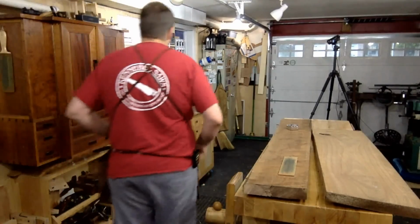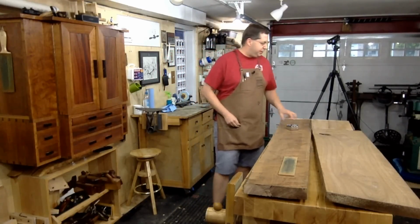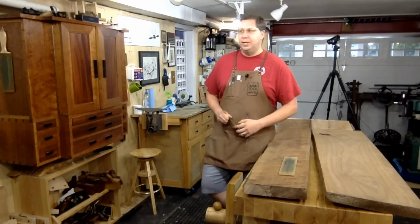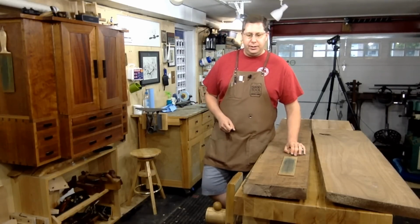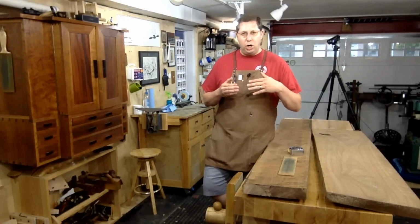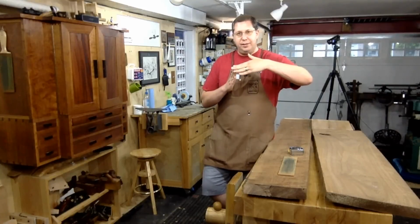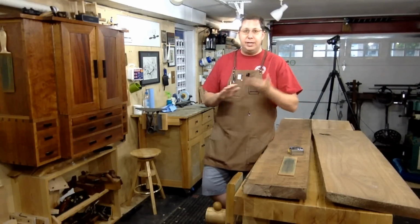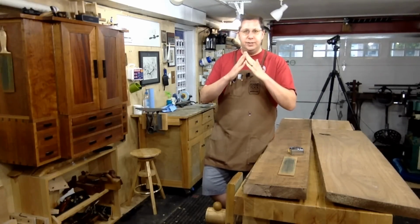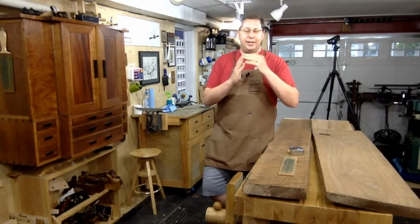You know, that's a really good question. I hadn't really thought about that. I want to say no, because I very quickly began to realize what sharp meant was working the edge all the way up to the edge. In other words, getting a burr. When you get that bevel all the way to the flat, assuming that you've got a flat, or you say you've got to lap it because you've got to restore that, when you get that burr, you have reached the zero radius line, the perfect Euclidean intersection of the bevel and the back. And that's what gets that burr.